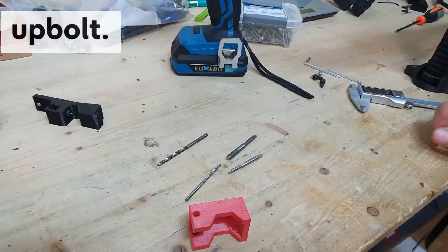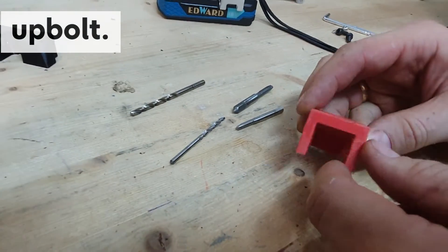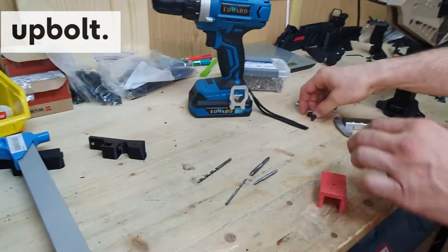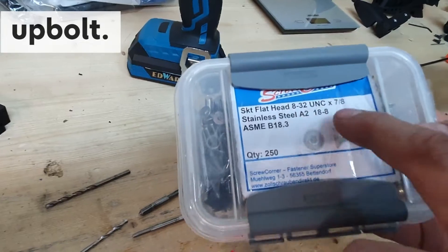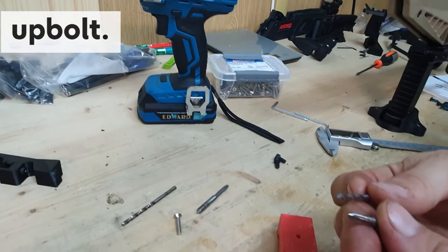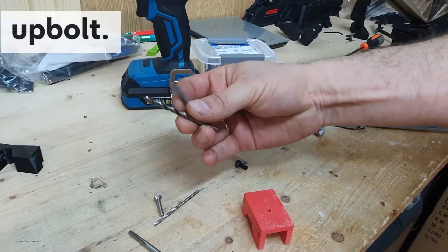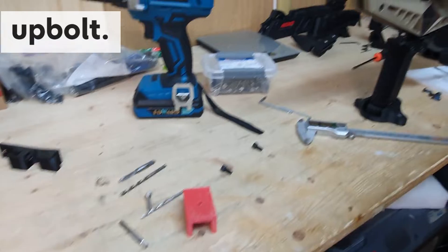Let's review what's in the kit. You will get this plastic item to get the right dimensions for cutting the metallic part. There is also the imperial-size screw at the top. For this we have a cutter and a primer drill so you can cut it. We also have M5 screws on the side and a tap and primer drill for those as well.